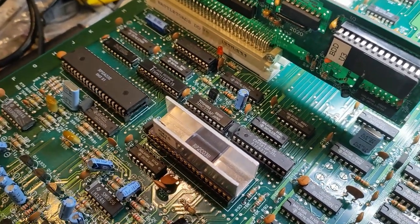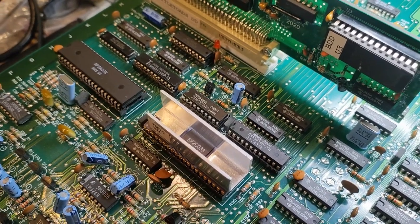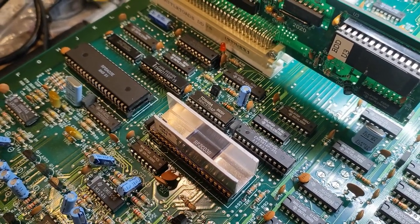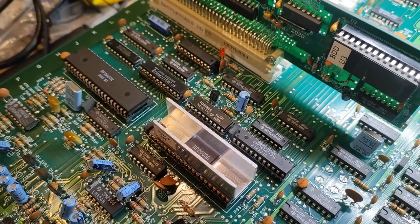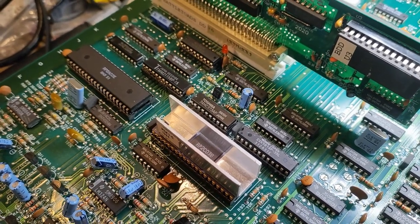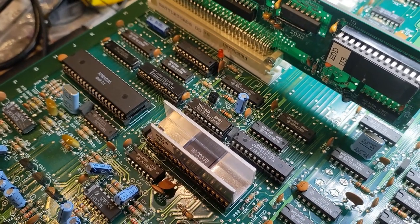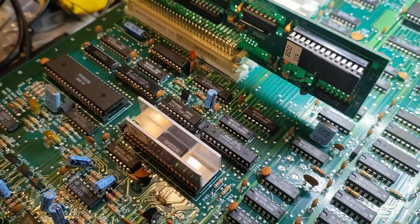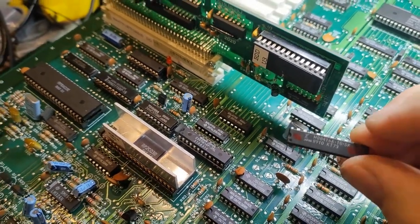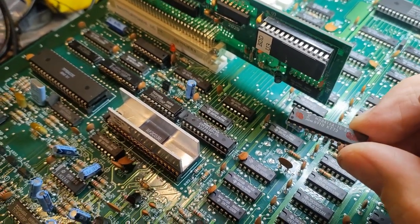But if what Ken was saying about the game board being plugged in is true, he told me the plus 12 volts and the plus 5 volts were actually reversed. So when he plugged it in, it just stopped loading, and then it came up with that error. That might have been what happened here. But as you can see, this RAM was actually bad.